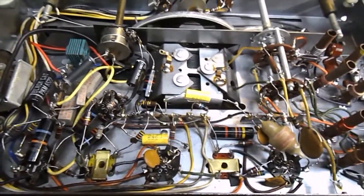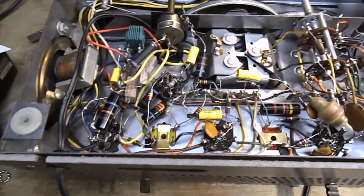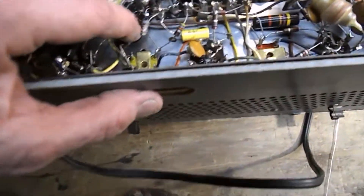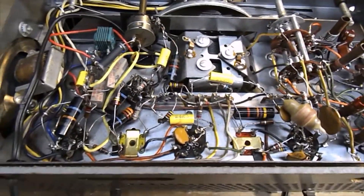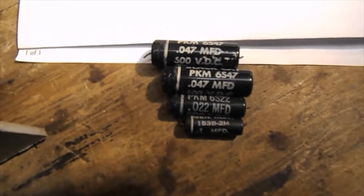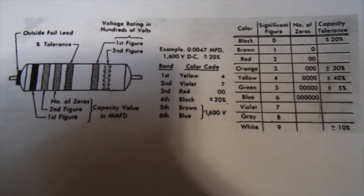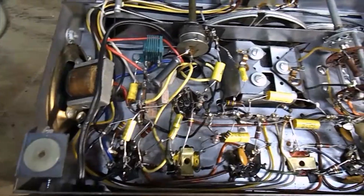I got four of them in — you can see the yellow ones — but then I started to run into some trouble. The other ones look like resistors to me because they have color stripes on them. There are five left, and I wasn't quite sure what the values were since the schematic isn't the easiest for me to read. So I asked Google if there's a color chart for capacitors. The ones I took out were well marked so I knew exactly which ones they were, and now I have the chart that explains the color codes so I can replace the other five.